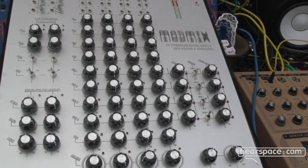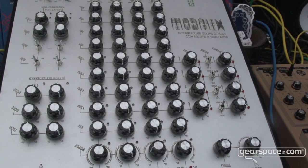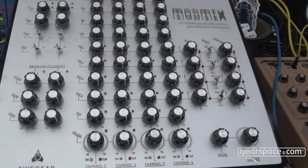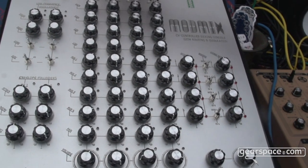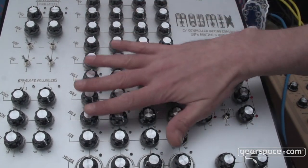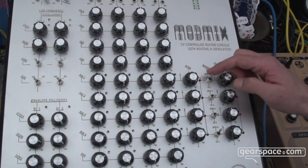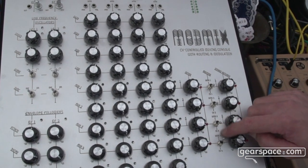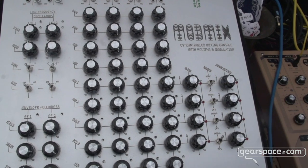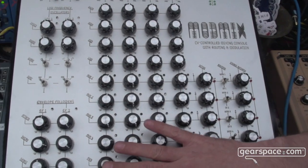It's not a studio mixer, it's not a DJ mixer — it's an experimental, weird mixer. It has four channels with a preamp and a simple EQ for sends, which can be normal sends or they can be fed back to each of the channels so you can make feedback loops. The sends, the panning, and the volume can be modulated by CV inputs.